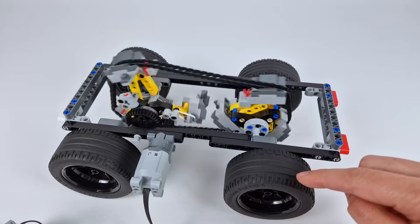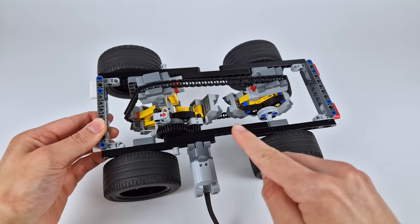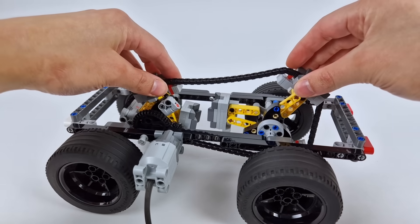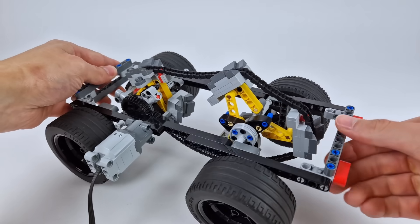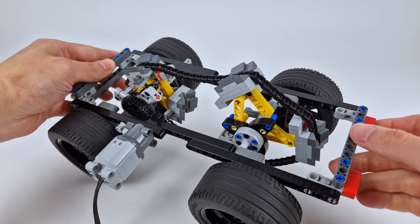But already, you can see what's probably the biggest downside of this automatic transmission design, which is that it is very big, owing to the fact that these two wheels need room to change size in order to automatically vary the gear ratio, and this isn't helped by these quite large assemblies around them to ensure that the hooks reliably latch onto the chain.